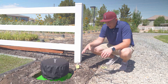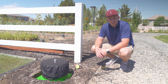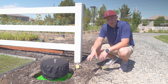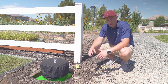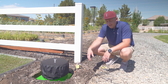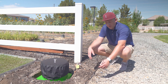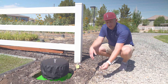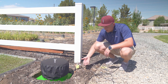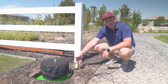I wanted to mention to those who may be panicking by the sheer amount of wire sticking out of the ground — here is where we've left the wire from the pre-construction phase of the house and where we're tying it to both our speakers and our subwoofer. We toned out and identified which speaker wire is which back in the house, and we're using zip ties to keep the wire for the landscape speakers tied together and the wire for the subwoofer tied together separately.